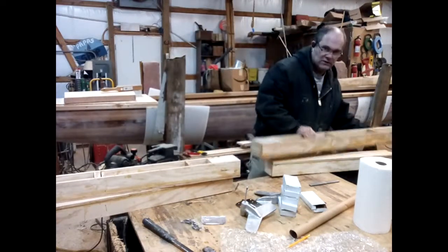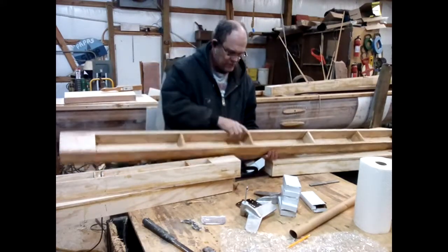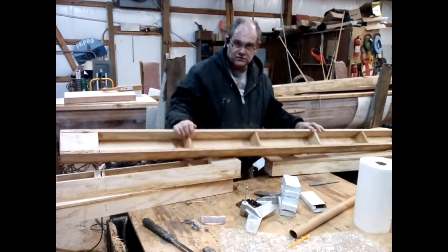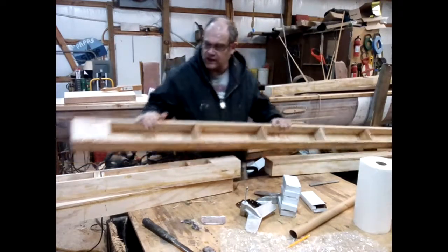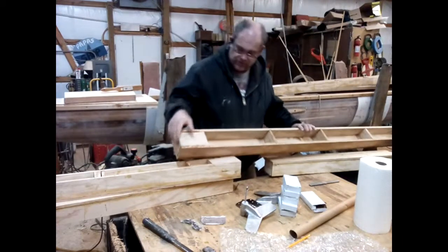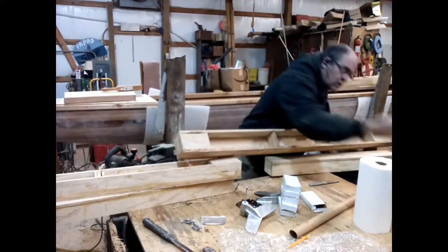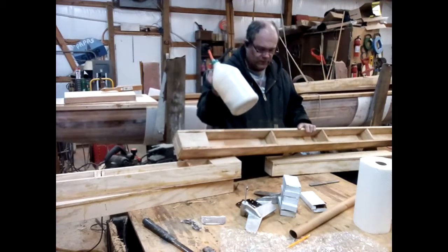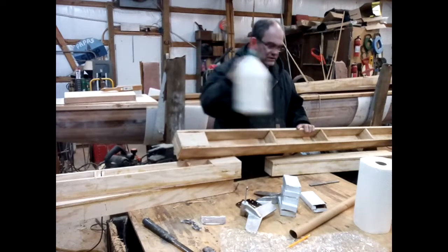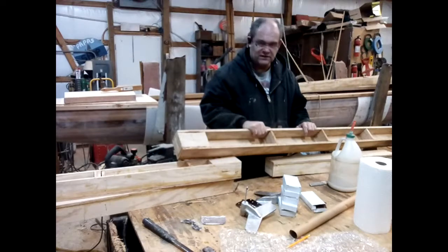And this guy, this is the main cross beam that's going to attach to the canoe. This is similar. We have these crushed bulkheads here, and then I just added additional spacer here, 16 inches off. And again, on the ends where the hinges are going to attach, they're solid. The labels come off, but I used this glue, this is Tite Bond 3. Some testing has shown that this is as strong as epoxy, and it's 1/3 the price. So I use that. It's completely waterproof. It's a good glue for laminating things together.